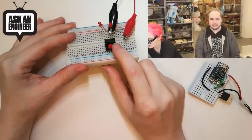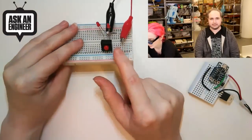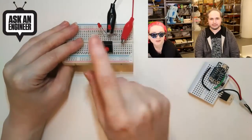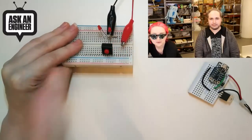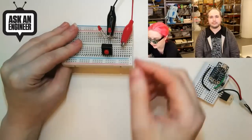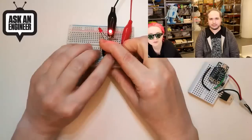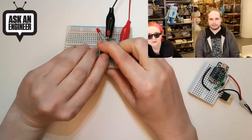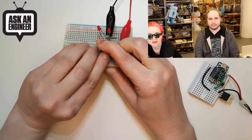Here's a little demo — I just have it plugged into a solderless breadboard. What happens is when you press the button it turns off, and on the left and right side, connected to the middle. So the middle pin is either connected to the left side or the right side. Once it connects to the left side, and then press again to disconnect, and then click again to go to the right side.